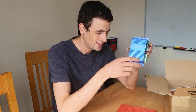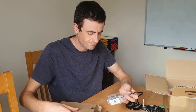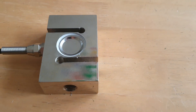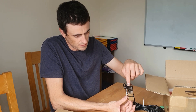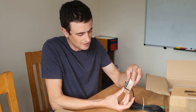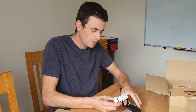That is a very sweet little bit of kit and I can't wait to get it fired up and check it out. Thank you to Jostine from NOI who sent these through and has answered many of my questions and been very patient with me. So this is the 500kg load cell — it can measure up to 500kg or 5000N of load in compression or in tension. It distorts the metal in here and changes the reading through a resistor, I believe. There's the connection to the controller.